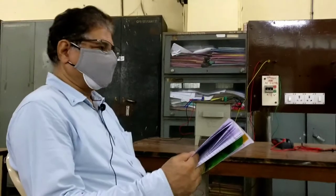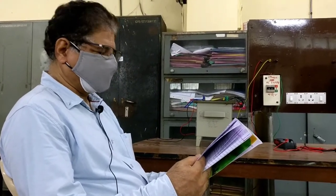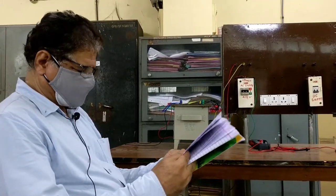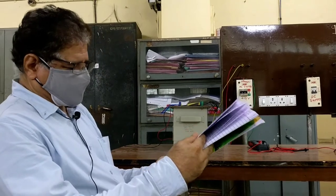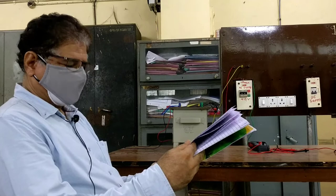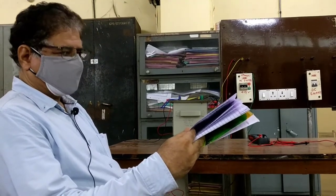Hello students, now we move to the second part of our routine test on the transformer — that is the measurement of voltage ratio. The measurement of voltage ratio, as per IS 2026, is of primary importance in transformer testing. As per the design and manufacturing specification, the rated output voltage must be obtained for the rated input excitation voltage at the terminals of the appropriate winding. According to the voltage ratio, the specified rated input voltage must be available at all tappings.